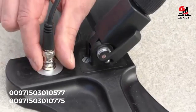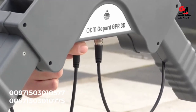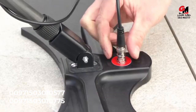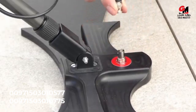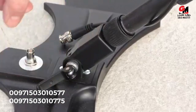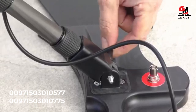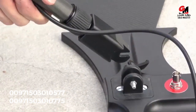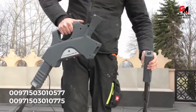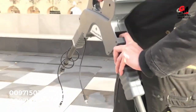To disassemble the GPR, we just need to disconnect all the connectors in reverse order. The next step is to open the quick release and slide out the telescoping antenna arms on both sides. To separate the telescopic arms from the main unit, you need to press the little silver button to loosen the connector and then pull it out.